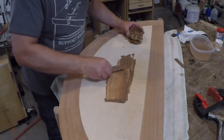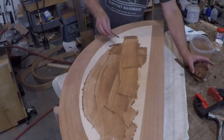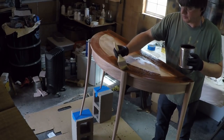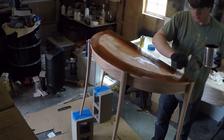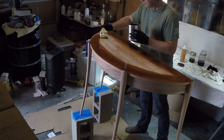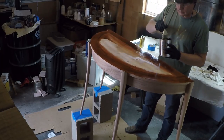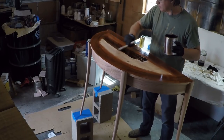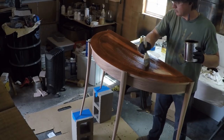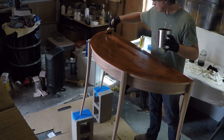To prep the top for the silver leaf I mixed up a slurry of grain filler to fill in all the pores in the wood — the silver leaf is so thin that any imperfections in the surface will show through. Freshly milled mahogany is often light in color and takes some time to darken up to that rich color we all love, so to help it along I dyed it with some custom blend of General Finishes dye. I also stained where the silver leaf is going to go. When I leaf it I'm going to intentionally leave cracks in the leaf so the wood shows through — not for a distressed look but an aged, well cared for look, like something that has been traveled around the world but well cared for.